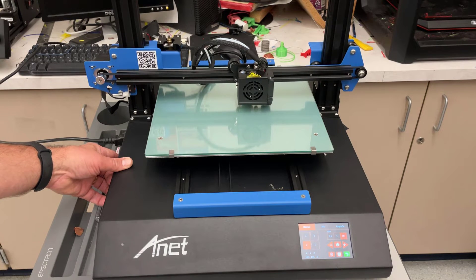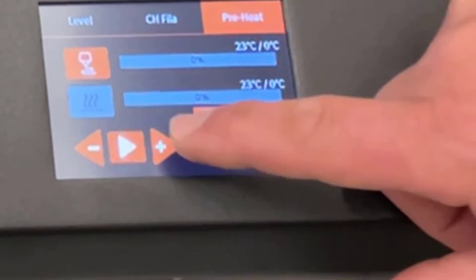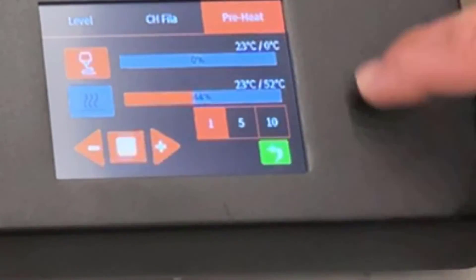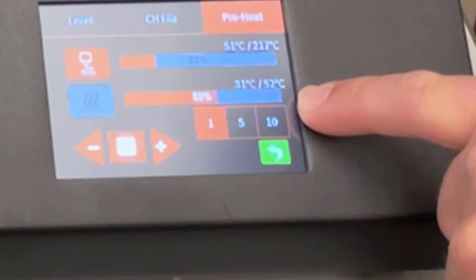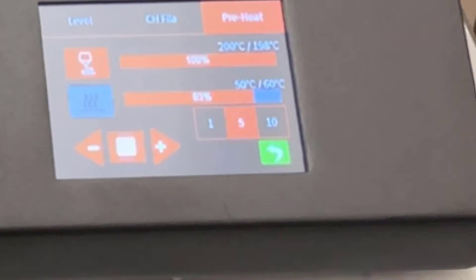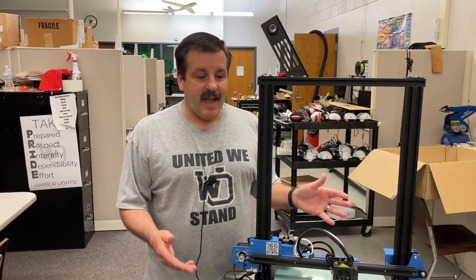That's just the way it's supposed to work, so life is good. Real quickly, let's see if the hot end heats up. There's the bed telling it to go to 52, hot end up in the 220s — just making sure everything works before I go to my first print test. The bed is heating pretty quick. I'm going to adjust these to the normal 200 and 60 that I usually use. You can see the bed is creeping up on 60 — I'm impatient so I'm going to call it good because I can see it's going to get there.